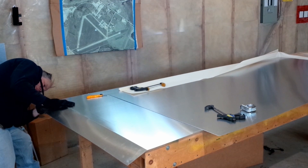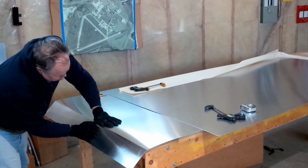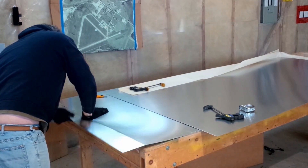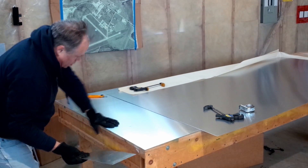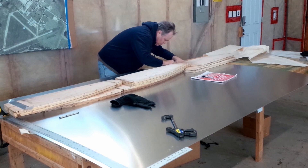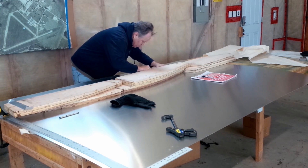What I didn't like was how it cuts. A common technique for the do-it-yourselfer is to repeatedly score the material 10-15 times, and then bend at the score to break it off. 6061 was far easier to work with than 5052, which required twice the number of score passes before attempting the break, as the aluminum is softer and appeared to want to bend rather than break.